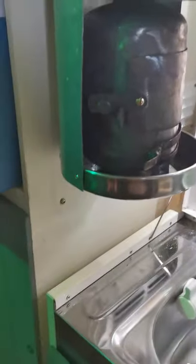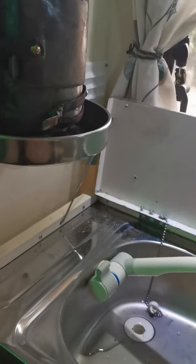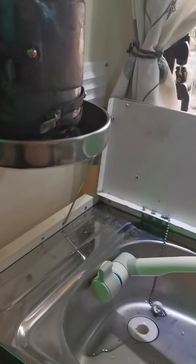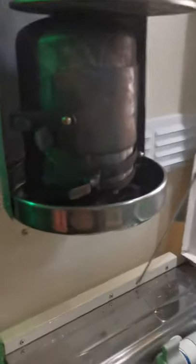This collapsible container on the top is the cold water feed — that goes to a pump, and the pump splits to a Y-splitter. One of the pipes comes straight to the sink here on umbilicals, and the other one goes to the hot water tank to pressurize and top up the hot water tank.